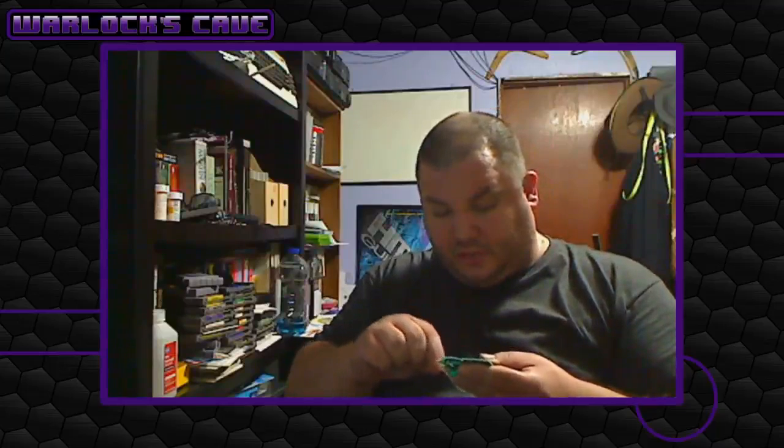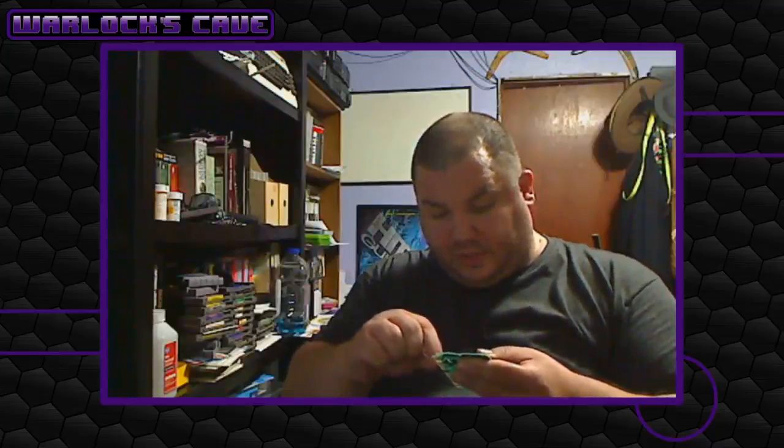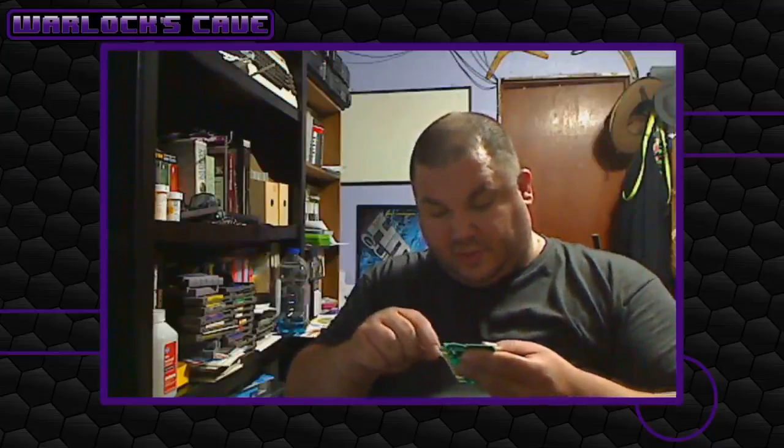Keep it to the pins. Don't ever go off of the pin areas. If you go off of the pins, you could be scraping into the motherboard and wearing down the traces, which is terrible. You want to keep those preserved as much as you can, and if you take off too much of the outer layer of the motherboard material, you can expose the traces, which are very, very thin and very easily damaged. That's why if you scratch a motherboard, it will not function. It will actually destroy whatever traces are under that scratch, unless it's an extremely, extremely shallow scratch.